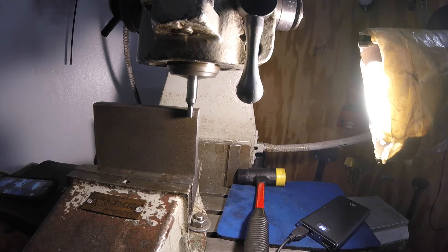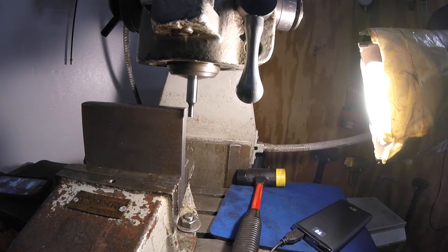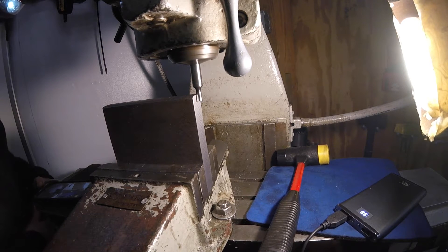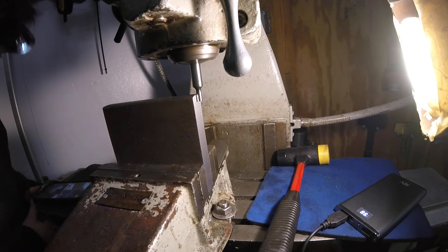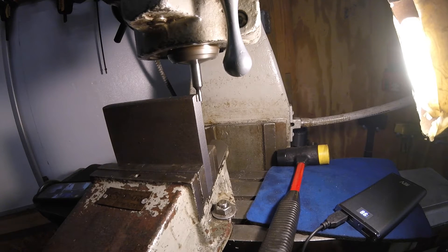There's a few thousandths before the pop, and there's right at the pop. So that's set for zero. Let me go to zero and bring it over 375 thousandths. Now I'm going to lock it sideways. What I'm going to do is wait for it to pop, and then since I'm going that way, I'm actually going to take out the backlash and start turning the other direction until the pop just comes out. Right there. I was going to set that for 100 thousandths off the corner, and I want to take it 250 thousandths off that corner.